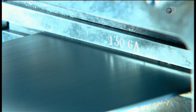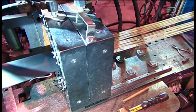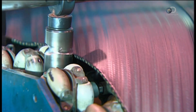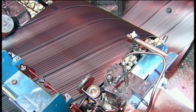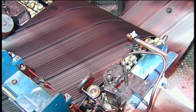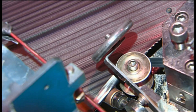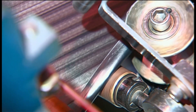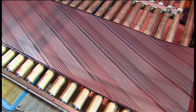The result is what's known as steel-belted rubber. They cut several of the steel-belted strips on an angle and fuse them together. This exposes steel cord around the edges, so hot rollers seal them with rubber. The steel-belted rubber will make the tires more resistant to punctures.